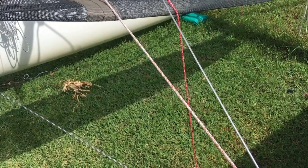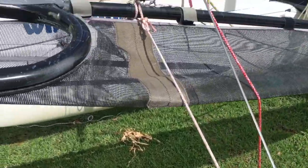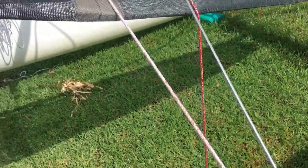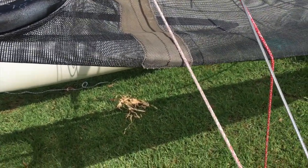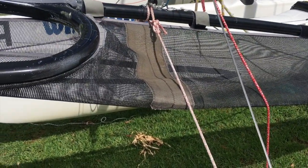As well as the pole bridles, we have intermediate pole bridles which come halfway along the pole. All the wires or ropes holding the spinnaker pole up — the bridle wires — should be tight to make sure that the spinnaker pole cannot move.